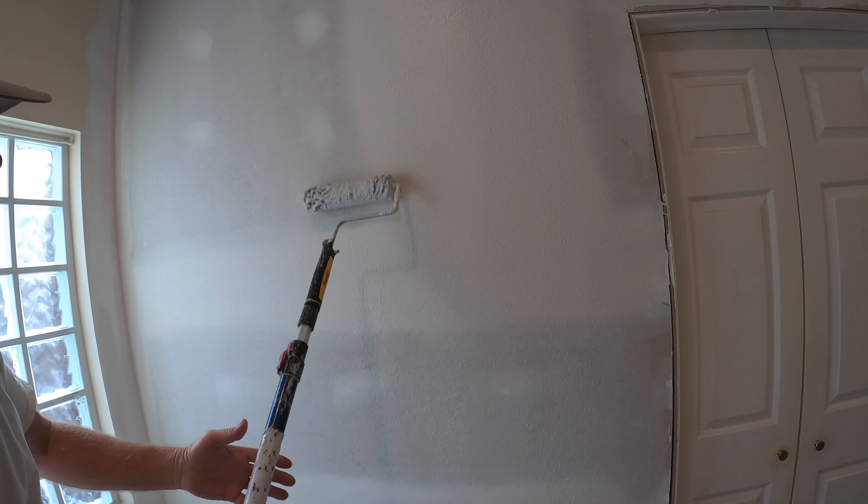You can almost touch up your float coat without even really skimming — just make sure you got all pit holes and stuff like that, and then do this. It covers really well and it can kind of be a skim coat if you're not really good at skim. It's an easy way to cover rather than using a compressor or anything like that. So there it is — that's roll-on texture. This will dry, then prime and paint, and it'll look exactly like the rest does if you do Southern Style. Everyday we do it.